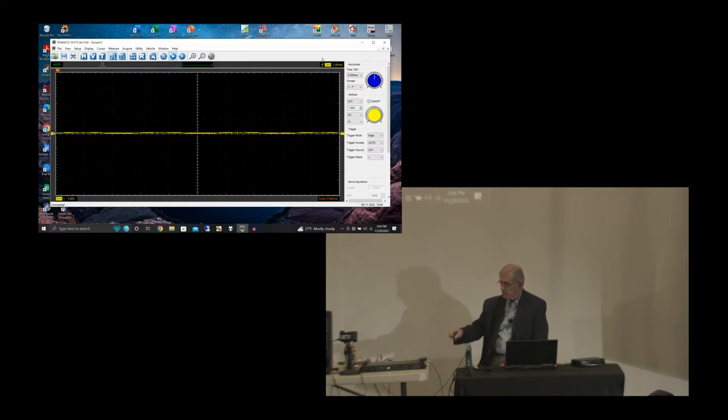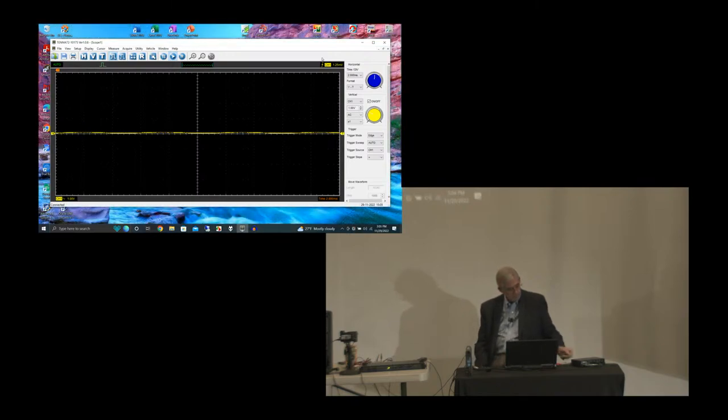And what's causing it is harmonic distortion out of the amplifier. When you send that into clipping, those wave peaks become square waves. And the square waves are represented in a high frequency out of the output of the amplifier. And so whether you realize it or not, when you clip your amplifier by putting too much into it, into a passive speaker, you're producing that kind of stuff out of the horn, out of the high frequency. That is the number one reason why biamplification was invented. Not anymore. Anymore, it's like Jake says, because it's hard. They found advantages of doing biamping in other ways.